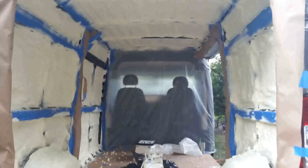This is the ceiling with one coat on it. It builds up where you stop and start, and I did have to use a saw in some places because once set, this foam is very tough. Here I've got about two coats up in the ceiling — over to the right is where the air conditioning goes, so I only put one coat there knowing I'd cut it out. Over to the left I put two coats, then a third, and it came out about an inch and a half thick — a couple places got a little thick.